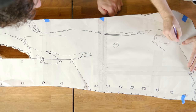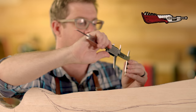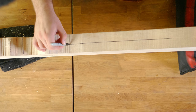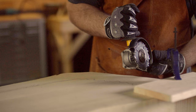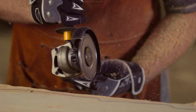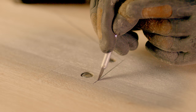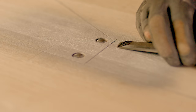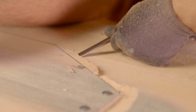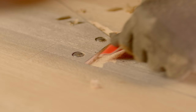We're transferring the template details onto the balsa wood and then we're going to start actually sculpting. We want to determine the center point of this three-inch block of wood — we're at an inch and a half. We're going to scribe a line all the way down this run so that when we come back to do excavation, we know we have to connect this line to that line, which is going to give us the bevel on this blade. It's always a good idea to test your tools on a scrap piece of wood first. We had really good luck removing the bulk of the material using an angle grinder with a chainsaw blade attachment, plus some die grinders, chisels, and wood gouges. The rule of thumb is if you're using a tool that's working for you, that's all that really matters. The trick is to work slow — you work fast here, you're going to blow it.